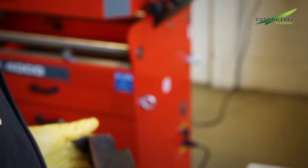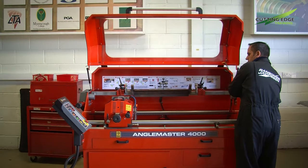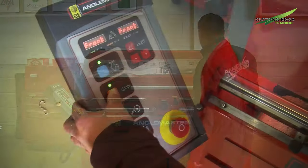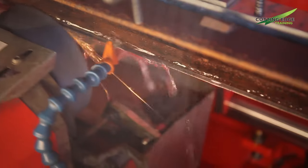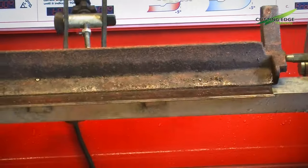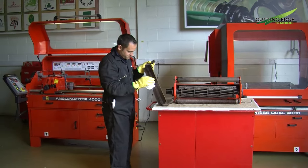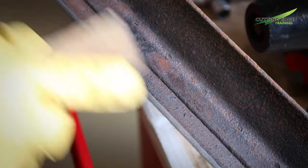This will be carried out and we'll grind the front edge of the blade putting on a five-degree relief, and then we will grind the top edge of the blade putting on a 10 to 15-degree relief depending on the bottom blade that we are grinding. Once the grinding process has finished we'll give it a quick check over and then remove any rough edges with a piece of hardwood, just rubbed up and down the lip of the blade to remove any burrs that may be there.